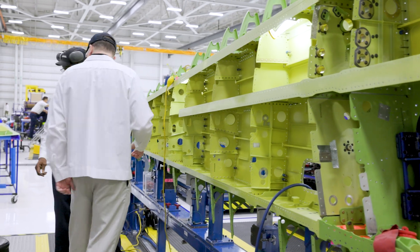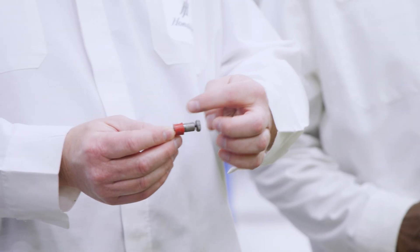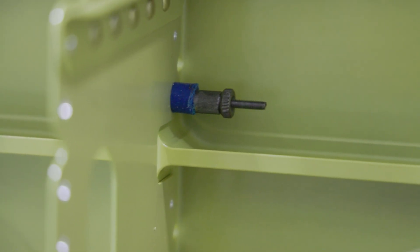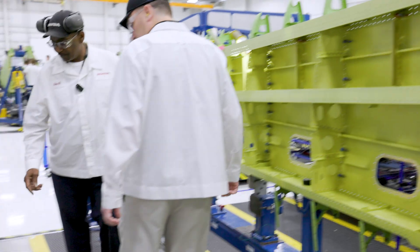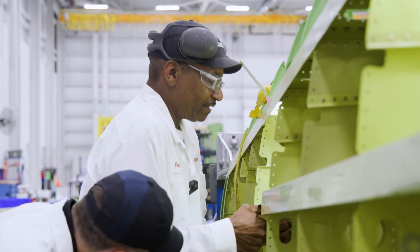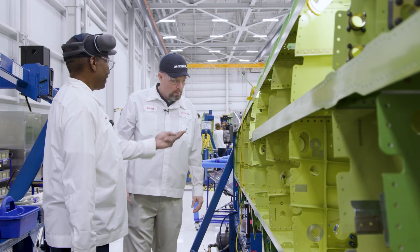Can you show me and let me put the next one in there? So you have a cleco — as you fasten the nut down, it basically makes the tip of it expand out in the hole, holding the part in place and everything is centered up with the hole that's already drilled. That way you don't misdrill anything. And now we're going to use a clamp right here, and that's just to make sure it sits down flush against the stringer here. Now it's set in location.